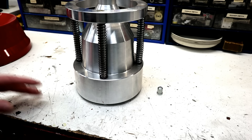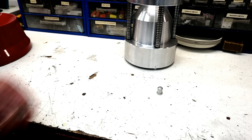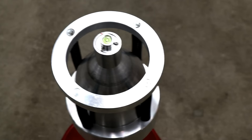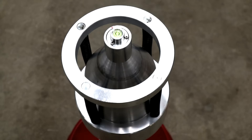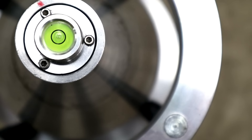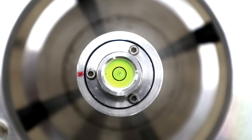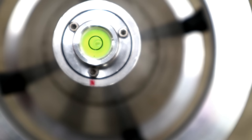The only problem with it of course is it's fragile, so you've got to be really careful when you put the wheel on. Just gave it a little shake — it won't stop for a couple of minutes; that's how little resistance there is. To set these up, stop it from moving. You want that little bubble perfectly centered. You can use the three screws to center it. Once you center it it shouldn't really be out anymore. And if you turn this now that bubble should remain perfectly centered no matter where it's sitting, showing that the pivot point is perfectly centered.